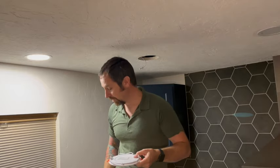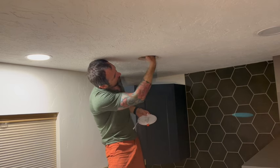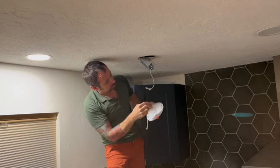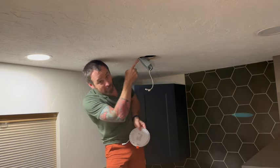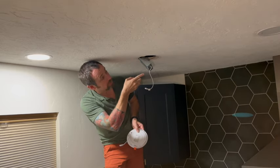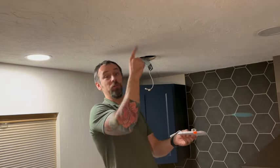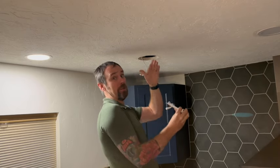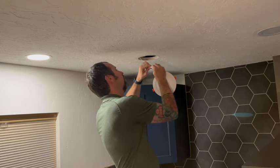There's a junction box, but there's no way to hang it. The junction box actually just sits on top of the drywall, and here it is, okay? So you get this kit with this wire and this wire to the box, and then the connection happens in here. Now your electrician can do that, and like I said, if you want to save your electrician some time and money, what you could do is cut the holes yourself, take this, put the box up there, let your electrician go up there, let the professional do it, and all you have to do is connect the wire,